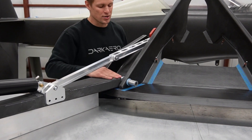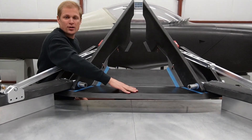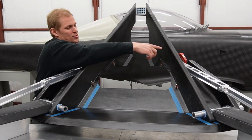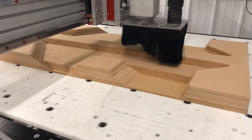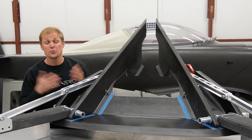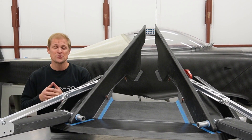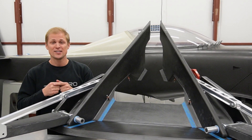The trunnion sits at the top of the strut, and then we have the trunnion frame. You've probably seen this component of the trunnion frame if you follow our channel — we did a whole long video on how we made it. What you haven't seen are these two components, which are the inner trunnion frame — a left and a right half. We made these on a machined mold and then infused those parts. If you're interested in making carbon fiber components, we teach an Aerospace Composites course — check out the link in the description.